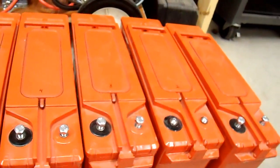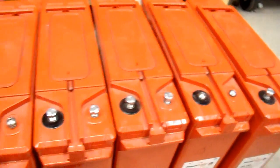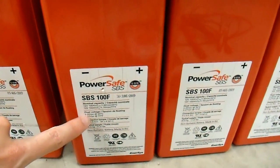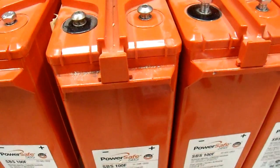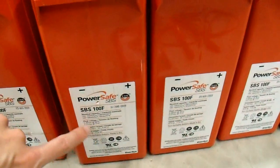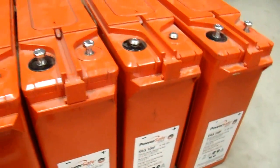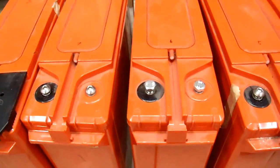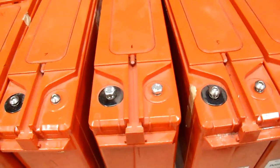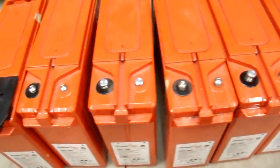The next step is to load test and see if the batteries work or if they have bad cells. They do have a very low internal resistance, and the reserve capacity on these is very good — much higher than most other batteries in this size. I should have seven batteries at 100 amp hours apiece. I plan on adding three Exide batteries I had shown previously, as the battery chemistry is similar enough. That will give me 1,000 amp hours of total capacity, but until I verify these work, that's just a dream.